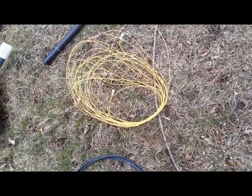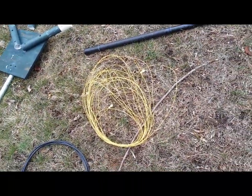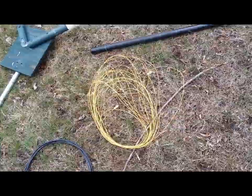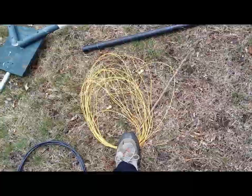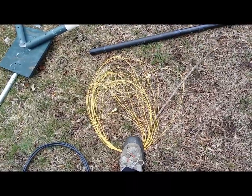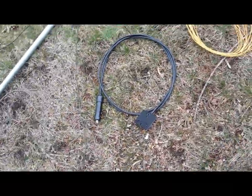As for the wire — I have it cut for around 14.150 MHz, roughly 71 feet — I think 70.9 feet of wire. This is the feed point.